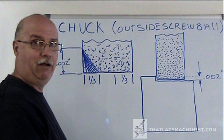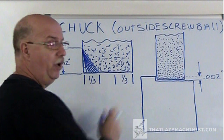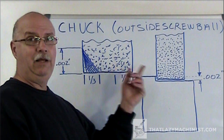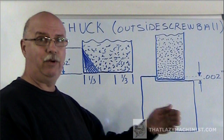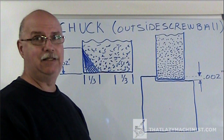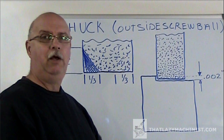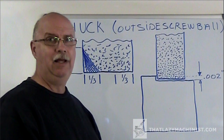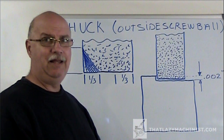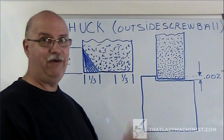That wear on the grinding wheel means everything on the worn side of the last line drawn is gone — it's not there anymore. When that wear gets to about one-third of the width of the grinding wheel's face, it's time to redress the wheel. But remember, your grinding wheel has two cutting edges. Since in the transverse axis we can cut coming and going, we can wear both edges down by one-third and still cut properly. Also, once you get close to that one-third width of wear, you're going to hear a difference in the sound of your grinding operation — that's because the surface contact between your grinding wheel and part is getting bigger and bigger, meaning more and more pressure. The more you wear down your grinding wheel, the faster it's going to wear down.